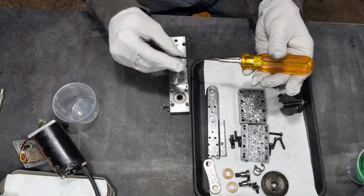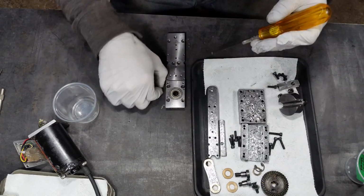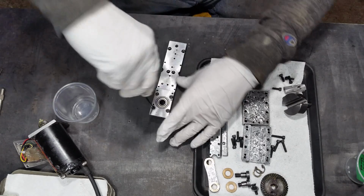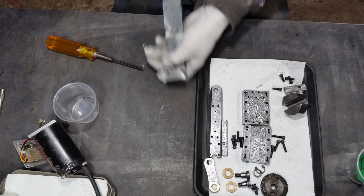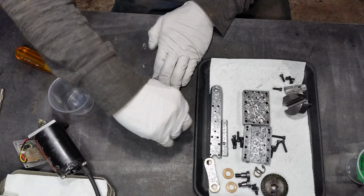Now this bearing plate also carries the motor, and the end of it is tapped for 4 8-32s, and really precisely aligned. I worked quite a bit with a file in order to get just the right alignment on those gears. And I'm really cranking these down more than any of the other screws in this assembly, because this part's not coming apart.